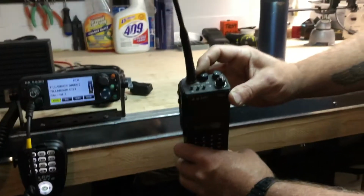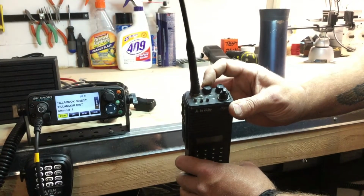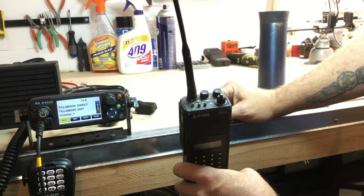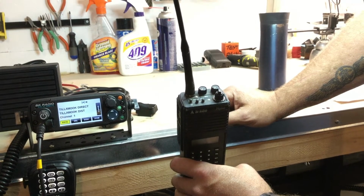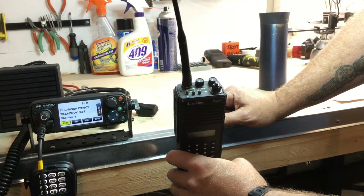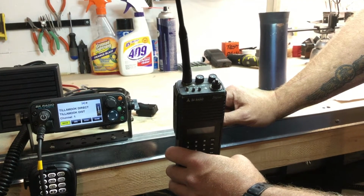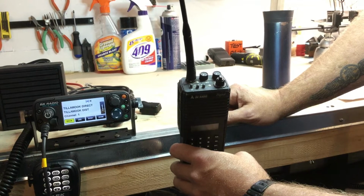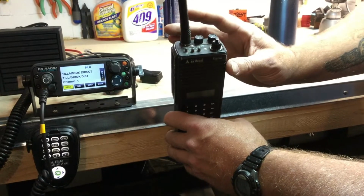This knob here is the code guard or squelch knob. The radio will work fine. It will actually work better than fine if you leave this knob all the way counterclockwise in what seems like the off position. What that means is that you are enabling the code guard function of this radio that will be selective in only making you listen to transmissions that have the proper code guard on them, which we know to be ODF traffic. So if you leave this in the off position, it will not hinder you from hearing people.